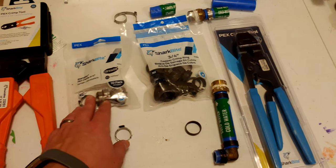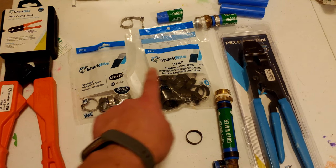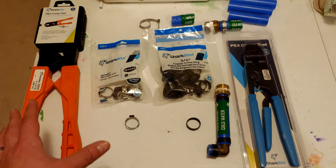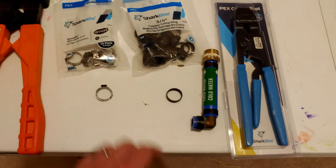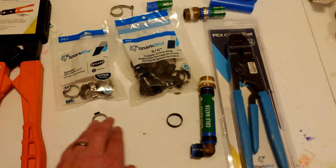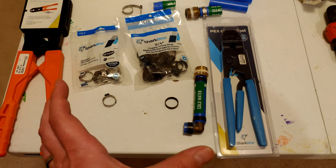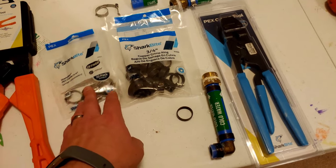To review: price isn't really a big deal, though it could be a factor on a large re-pipe job — 10 versus 25 connectors per pack. Tools are comparable in price, though for large jobs you might use something more sophisticated with air compression. Effectiveness is equal — both will bite down and secure your PEX to fittings just fine. Sometimes it comes down to consistency; if the existing work uses one type I might match it. Otherwise I'll probably use the stainless clamps: easier to remove, smaller tool, stainless won't corrode, and easier to squeeze.